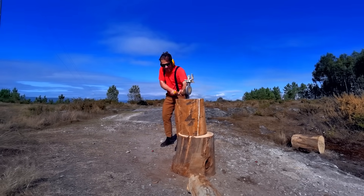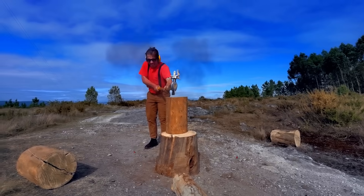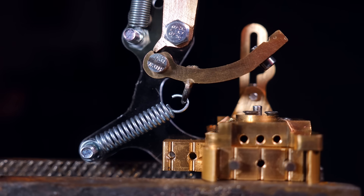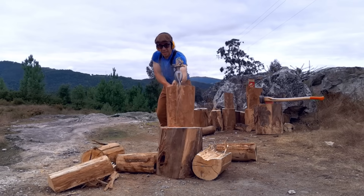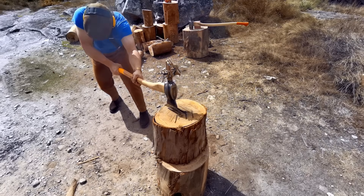Editing Joel here. I've been looking at the footage from the tests all day and I think I figured something out. There are three main reasons why some of the logs don't completely blow apart: the wood itself, the timing, and the penetration — I told you it was important. If I strike the log with too much force, the penetration opens a big crack and the gases don't seal properly and escape. If it's too little, the axe jumps out. Same goes for timing. With the new mechanism I have the constant force of the spring, but depending on how hard I hit the log the explosion goes off sooner or later. The best is to go off as soon as the blade gets in the wood, because the momentum from the swing keeps it from coming back up. If it happens too late, the axe jumps out; if it happens too soon, the axe doesn't even get in.